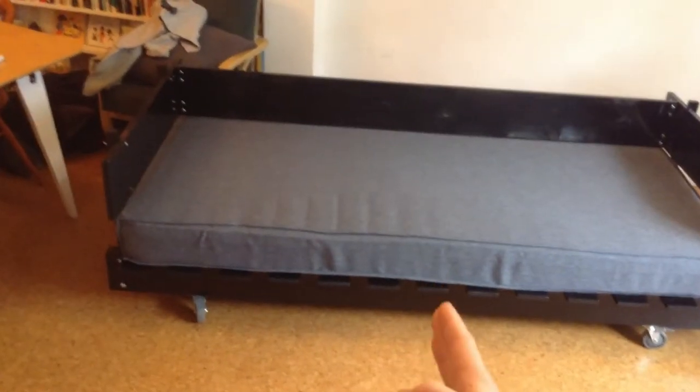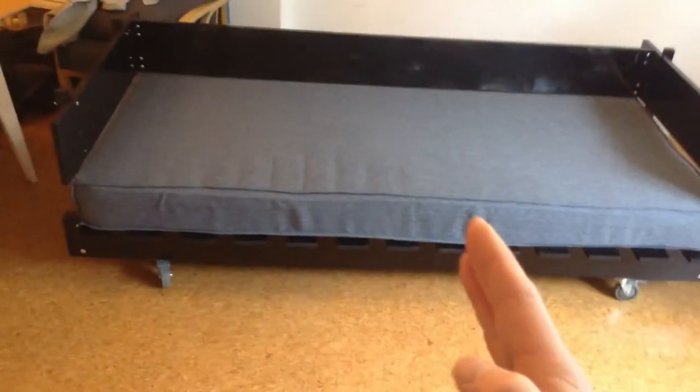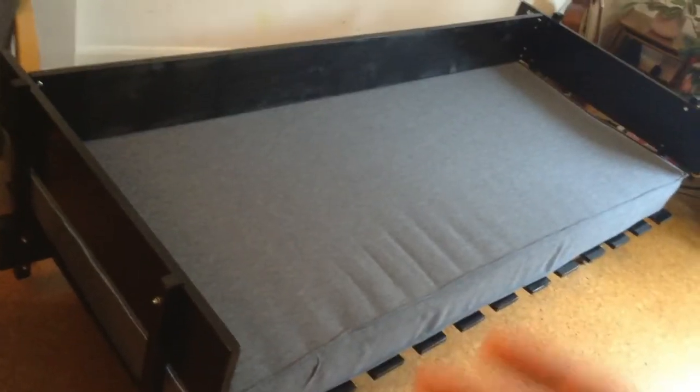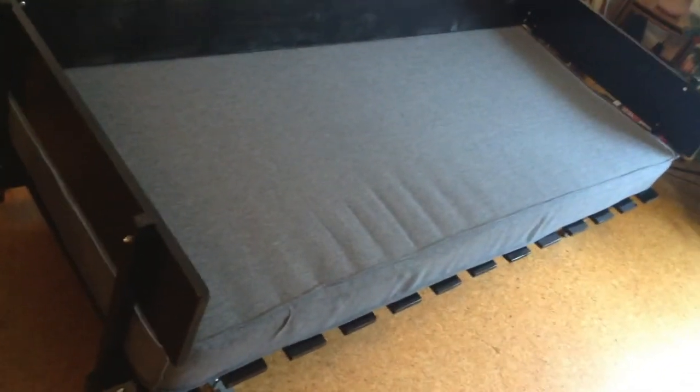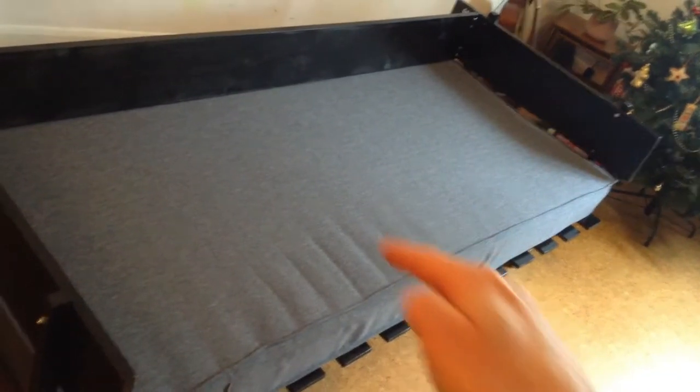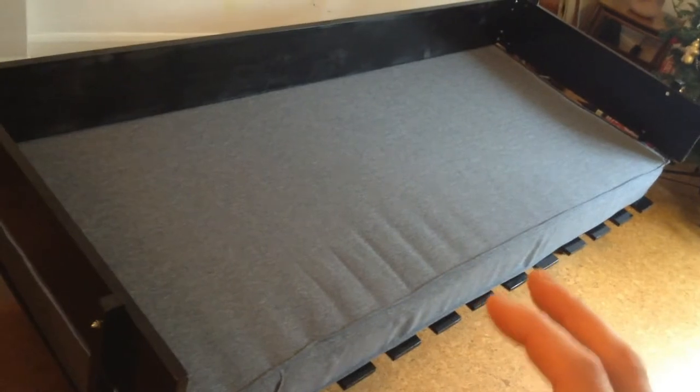With these joists, get them in 2.1 meter lengths — 7 foot — and strike a line down the center of the joist. Set out from the center, not from one side to the other. The crucial thing is that every element, if it breaks, can easily be replaced or repaired — you don't need to pay an upholsterer. This mattress is a standard single mattress; in the UK that's 190 centimeters in length by 90 centimeters in width. If you ever want to replace the mattress, you just buy a new standard-size single mattress and substitute it in.